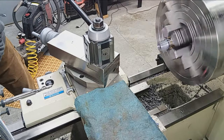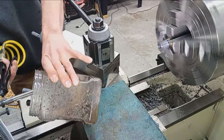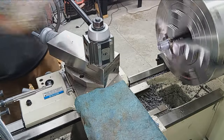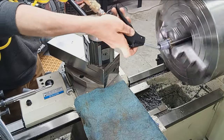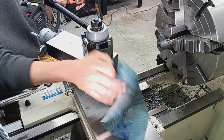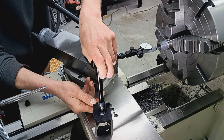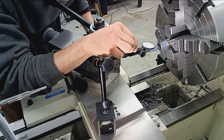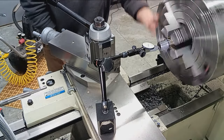Clean off the reamer and the bore, inside the bore. Okay, there's the reamer. All right. Okay, let's check, make sure we're not getting any run out while we're early in the game here. And then we'll just touch off. Something to check. Okay, so that's the pre-bore section.